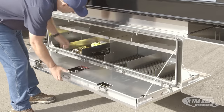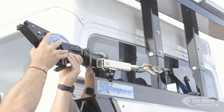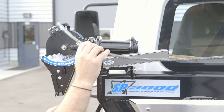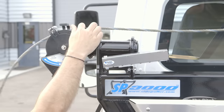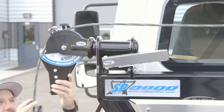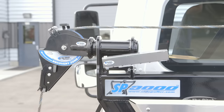Here I'm going to show you how to install the outer recovery boom head. As you can see, you just put it in, rotate it 180 degrees, and lock it in. Then you weave the wire rope through the top, remove the outer cover — which is retained by snap buttons — put the cover back on, and you've reaved your wire rope through the boom head.